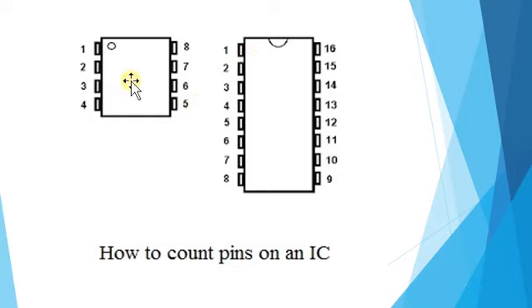This is an eight-pin IC, and because the dot is here, this becomes pin number one. In this particular 16-pin IC, the notch is here — wherever the notch appears, the extreme left of that will be the first pin. After pin number eight, pin number nine starts from the bottom and goes upwards in counter-clockwise movement. To summarize: when using IC trainer kits, you will mainly use DIP ICs with a pin width of 0.1 inch, and numbering is based upon the placement of the dot or the notch.